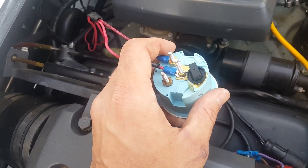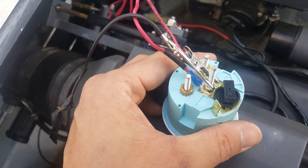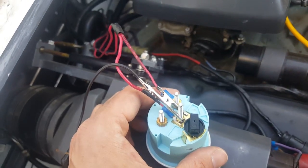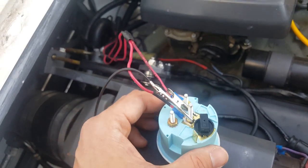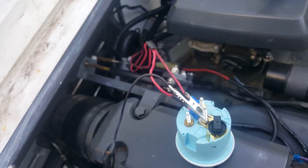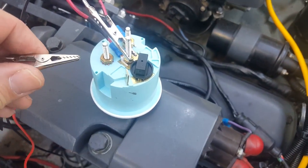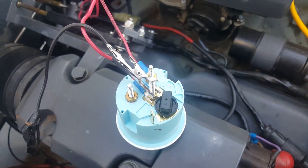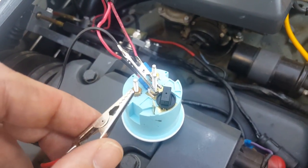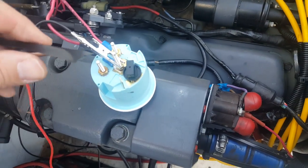Keep all your grounds in one spot — that's the center spot right there. I've got an alligator clip on the center pole, and that's going to be the ground. The next part you need to be careful about is when you're hooking up your positive lead. Obviously, you don't want those two to touch, otherwise you're going to have some issues. So take some time and put some electrical vinyl tape around this so you don't accidentally short it out.